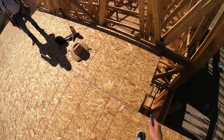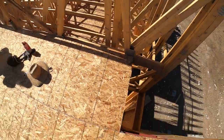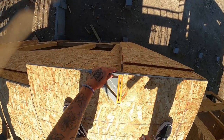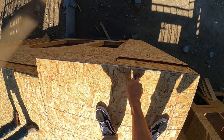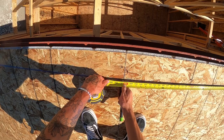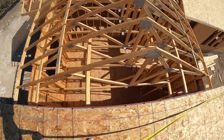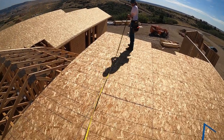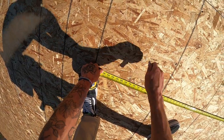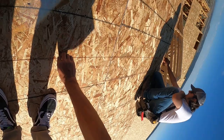Something else I like to do when we're snapping walls is mark like that — which just shows exactly where things land. I'm going to mark 14 foot eight and a half inches, 20 foot eight and a half right there, and then I need to add seven and a quarter. Let's come back to kind of the middle of this sheet, just the edge of that bump out. It's camouflaged. Let's see if we have enough chalk on our line to get another snap out of it — nope.